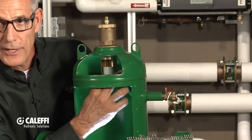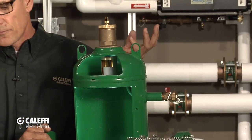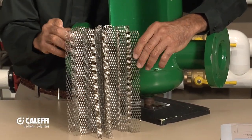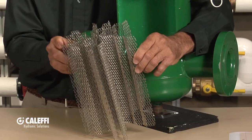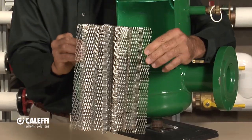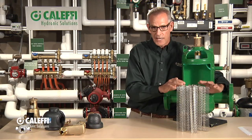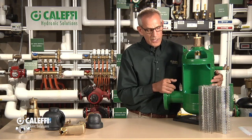If you notice, that float is sitting right about the same level as that little tube that goes out the side — that's one of the unique features we put on it to make it easier for the installer and to commission the system the first time and get all the dirt and debris out. In this one we use a stainless steel coalescing media. There's a lot of surface area — so sharp I've already pricked my finger on it — and those sharp surfaces are going to cling those small bubbles, force them into larger bubbles, and let them rise up. We use stainless steel here, like the composite in the brass version, because it's not sensitive to harsh water conditions or electrolysis. So if you have a system with glycol that goes bad over the years, it's not going to attack this media and cause it to flush into your system.